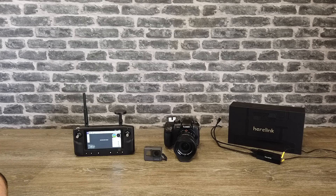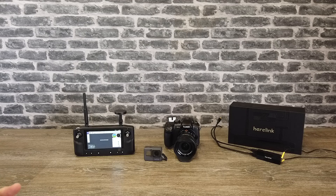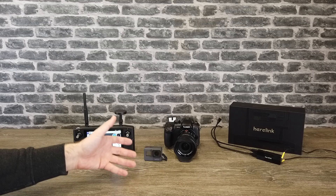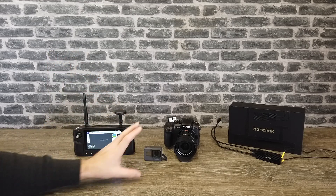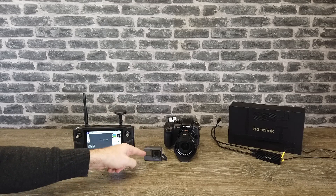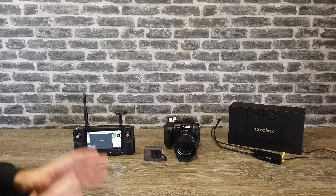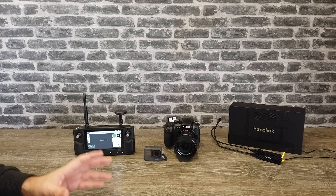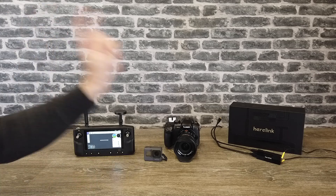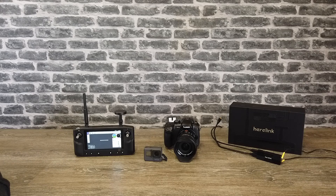If you're looking for a modern GoPro it's the Hero 7 Black, the Hero 2018, the Hero 6 Black, and the Hero 5 Black. The reason the Hero 2018 supports it is that it is basically a Hero 5 Black. That one is worth a look as a good digital FPV camera. As this system is digital, you cannot connect up an analog FPV camera — any camera must have HDMI output. On the big cameras it's generally not a problem, but on the small ones stick to the GoPro line and you won't have an issue.